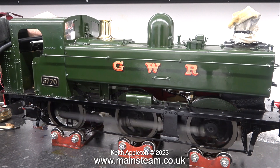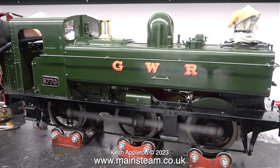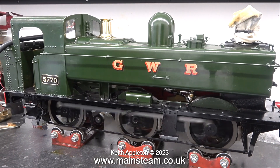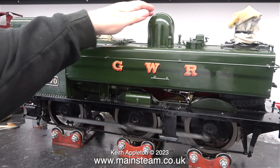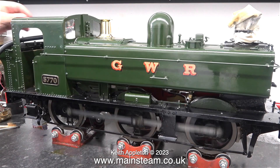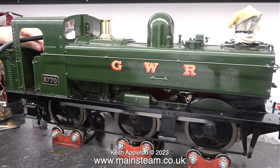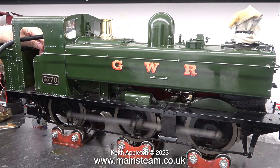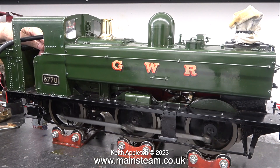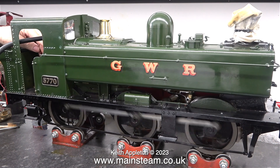All I have left to do is strap the oil pipe to the existing piping and fit something to stop the nuts working loose underneath the suspension. For this I'm going to use silicone rubber tubing. Lock nuts are okay but very fiddly if you need to adjust them. Silicone rubber tubing in conjunction with the spring pressure stops the nuts from working loose. The engine now works quite well in forward and reverse. Now it's the end of the episode and the series. Stay safe, stay healthy. Thanks for watching and I hope you found it useful.